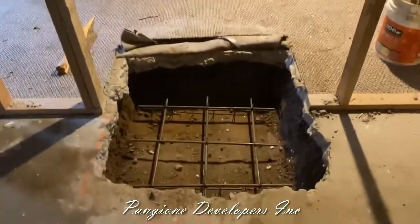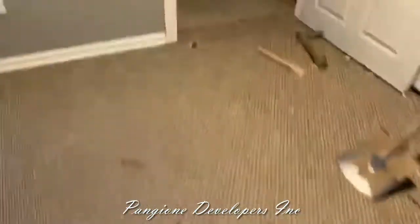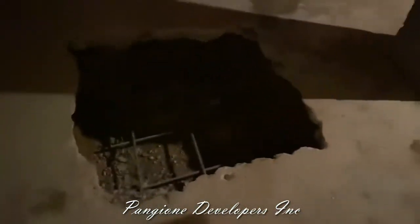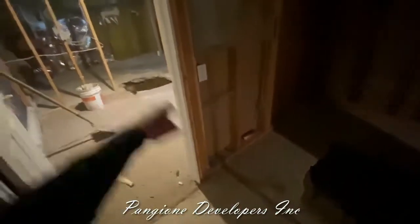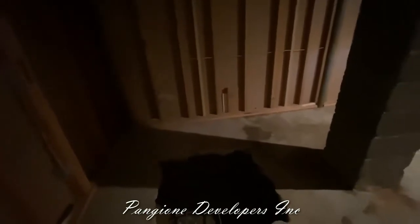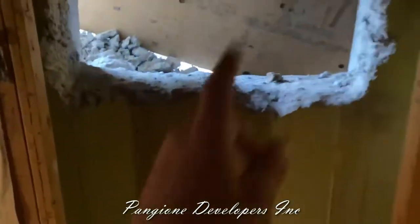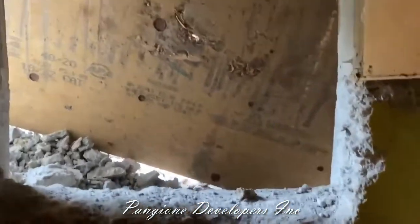This allows us to have an open floor plan. Here's one pier over here, and we'll cross into the utility room — here's the second pier, they almost line up. There'll be a column straight down to each footing, and those will be catching the point loads of the second floor. We also just cut open an access into the crawl space right here, and all that work's been done in just the last hour or so.